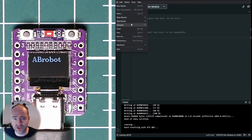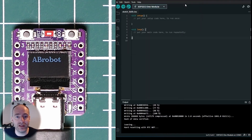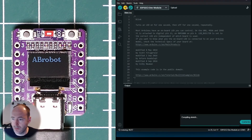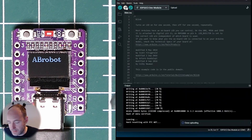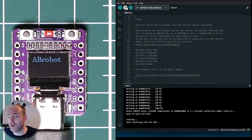Let's try a blink. One curious thing is the screen hasn't turned off. Let's try and flash that onboard LED — it's actually on pin 8. There you can see it's a blue LED and it's flashing, which is a good sign. That basically confirms we've got the right board selected and we're able to program and communicate with the chip and the I/O.